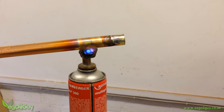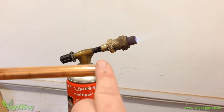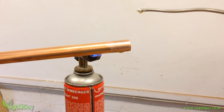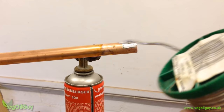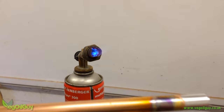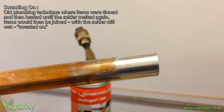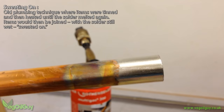The process is a little bit quick and hard to see, so I'll do another one. Clean the pipe, add flux, apply heat a little away from the fluxed area, smear the area with solder, then quickly wipe away with a cotton cloth — and there's a nicely tinned pipe. The old plumbers used to sweat on fittings, but this tinning approach works great with soldering fittings.